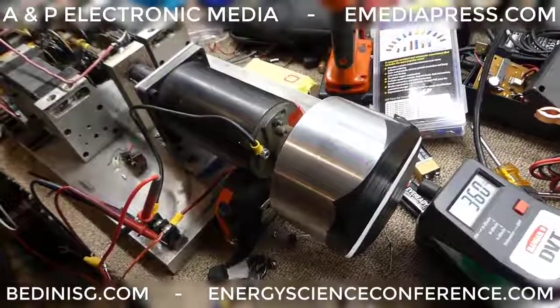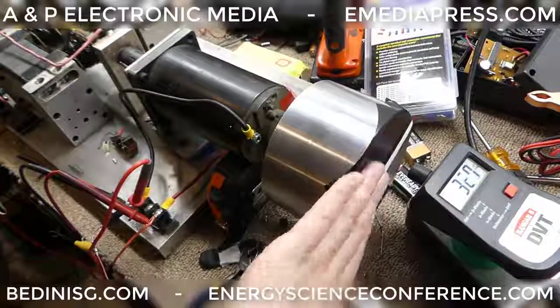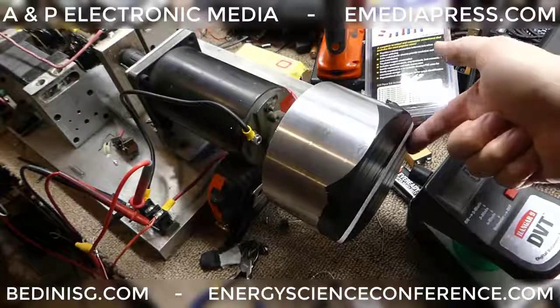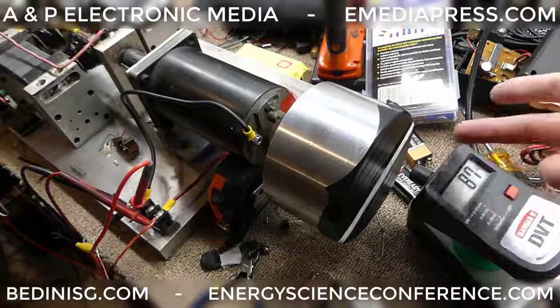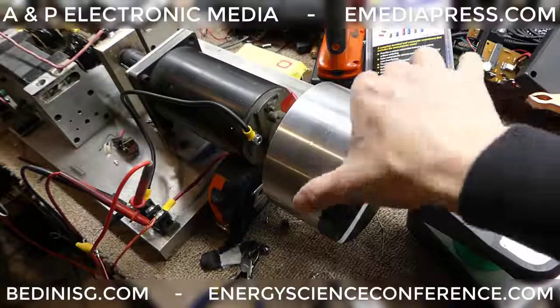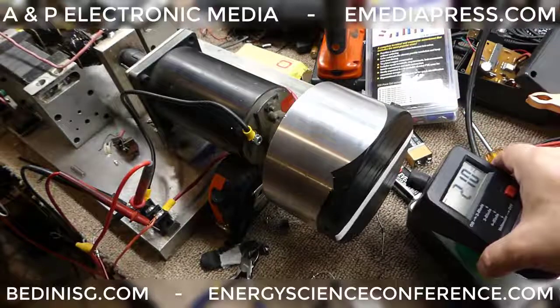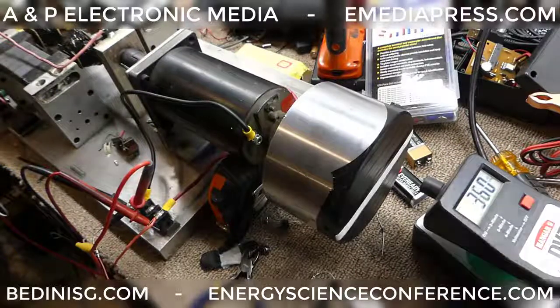I've got an optical tachometer. I just blackened this out to get a better reading — it's basically taking ambient light into a receiver. It doesn't have its own light source. This is for remote control airplanes simulating a 2-blade prop, so for every rotation the light bounces off into the receiver and tells us the frequency or speed. Typically when just sitting there it'll show about 360, which is from the 60-cycle coming off the lights. The variac is set to about 12 volts or so.